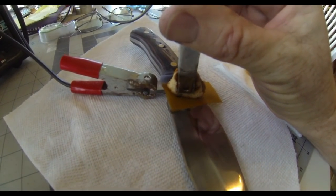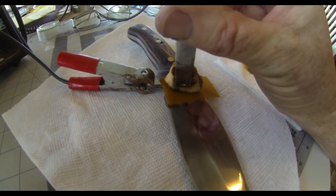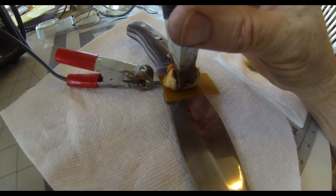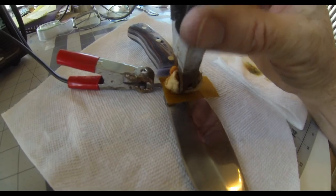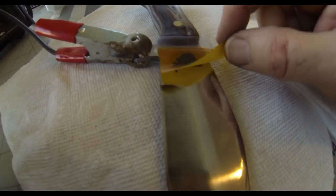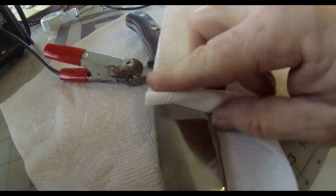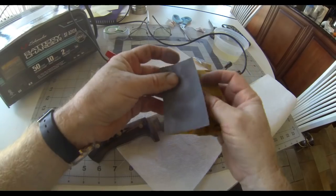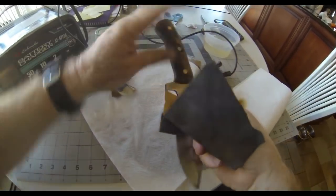The blade is all polished, so I figured I'd go back and put my maker's mark in the correct position. I mounted it a little higher on the blade where I normally would with a knife that did not have guards. I covered electric or electro etching — maker's mark etching — on a separate video if anybody's interested in the details. I'm just using a 12 volt car battery charger, as well as some salt water, and a stencil with my logo on it. My logo is a two-tone maker's mark. Now the etching is done, and I'm using 1500 grit paper to polish that etching, bring out all the details, and knock off all the rough edges.